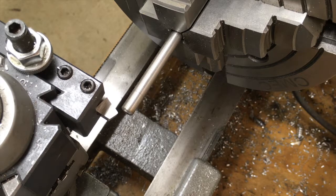I've got the camera clamped onto the lathe bed — it's the only way I can film this, so it's probably going to vibrate a bit. Until I start getting some YouTube ad revenue I don't have a mount that doesn't vibrate. I've got it all oiled up and indicated in to within about four tenths. Eventually when I have a collet chuck that'll make it a little easier, but in the meantime this is what I've got. I'm going to set that as my zero and go in five thou.